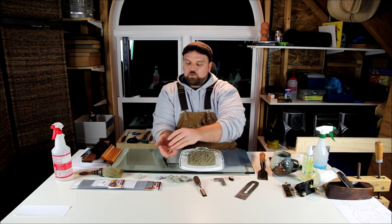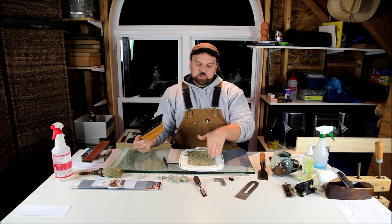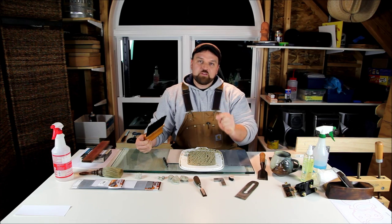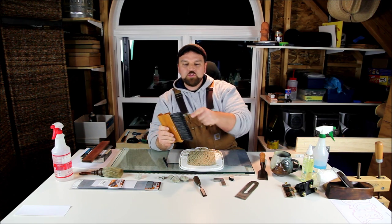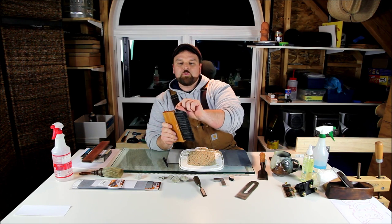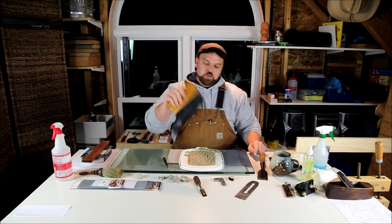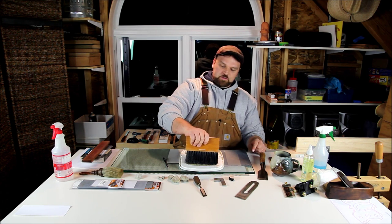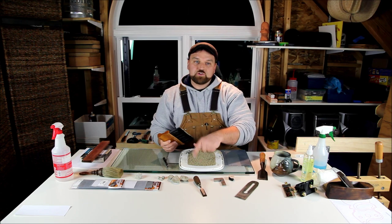You move to finer and finer stones, and finally you get to a place where this would probably work wood okay. But just a little bit more effort — maybe another five minutes — and you could have this razor sharp. In comes honing. Honing would use very fine particles, similar to the tips of the bristles of this brush, to then polish this metal surface. You'd go over it with this nice fine surface and it would leave you with a much keener, constant edge all the way across.